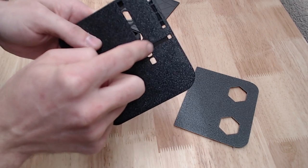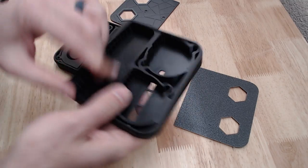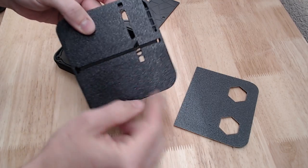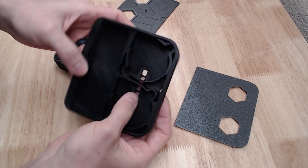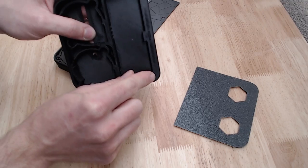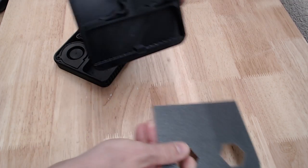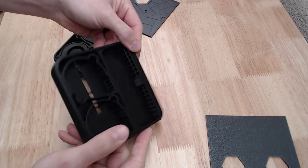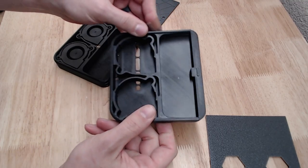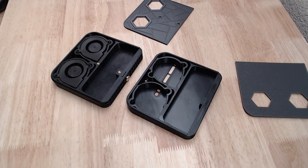You could add a little angle cut right there to reduce dead space and save carbon material - not sure you're getting airflow in that area. There's something to be used in that corner; I should reach out to see what the intent was, because it looks like you could wrap around backwards on one side, but on the other side there's no way to route the wiring back around. Maybe a mesh or grille printed flat that slides into a groove to keep material from falling out - though once it's installed it probably won't be a big problem. Overall I really like the design; it's definitely moving air and it's a pretty cool design.